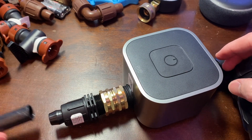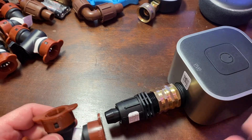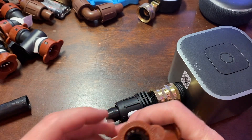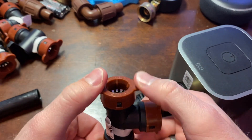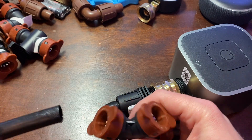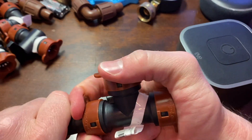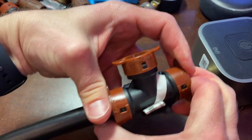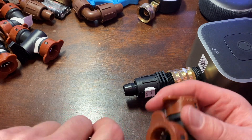Let's talk about connectors for the half inch poly, because not all connectors are created equal. This connector is called Drip Lock — it's by Hydro Rain or Orbit. It's kind of like the SharkBite for PEX. You shove the poly in there and a bunch of little pins lock around the poly. If you want to disconnect it, you squeeze the pins down and slide the poly out, though in practice it's harder than it looks. Something that helps is pushing the poly deeper in as you're squeezing the pins down. One reason I don't love these is because that maneuver is pretty difficult. These can leak a little if you don't shove them really far in, but if you really shove it in, they don't leak even with 70 to 90 PSI static pressure.